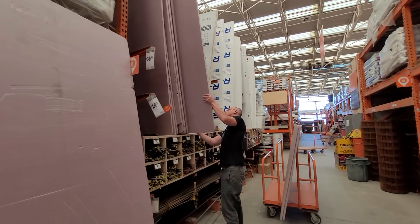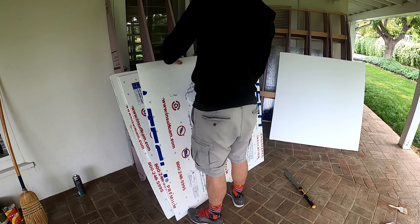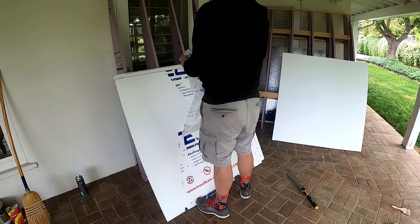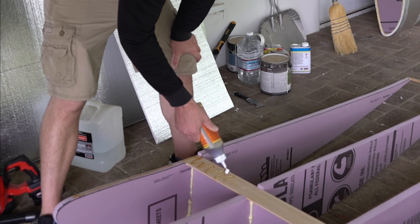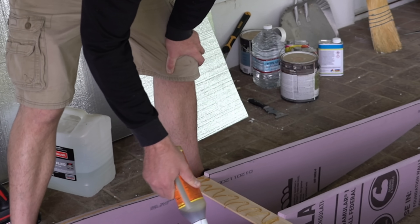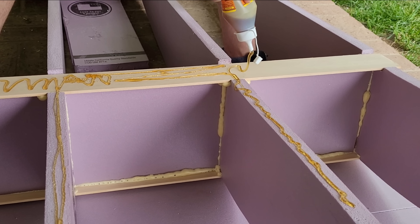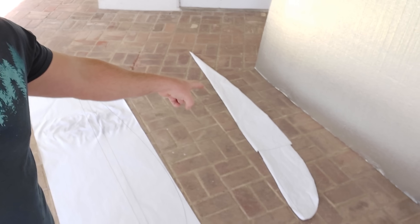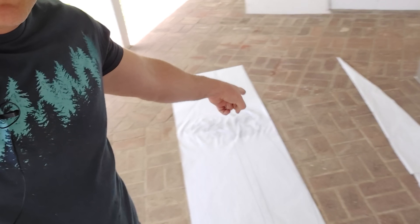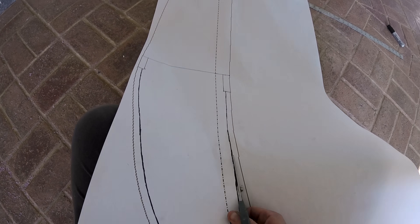Up to this point, I used 1 inch pink foam and 1.5 inch insulation foam with the silver backing, both sourced from Lowe's home improvement stores. In addition, I used wood from the aircraft spruce location near me. Here I spent a little extra to get a stronger main spar which will carry the main forces experienced while flying. I blew up the airfoils at the local Kinko's print shop to make some templates and then started cutting.